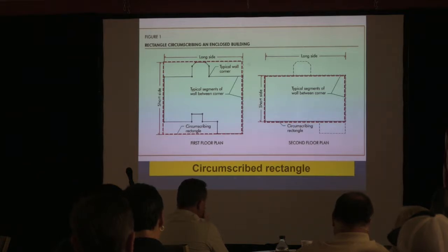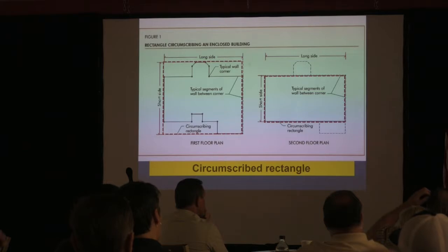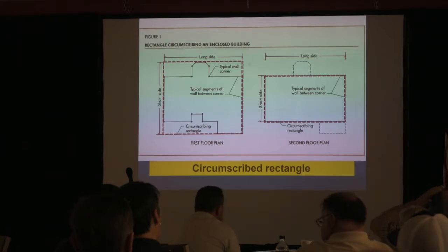Bill knows this, but do you guys know that hard coat stucco is actually a method of wall bracing? You have to fasten the mesh on there at specific intervals, but it's in that column there. So it is a wall bracing method because it does stiffen the wall up. I don't know, based on what we see, Bill, though, I don't really want to rely on that for wind bracing. That's what I'm saying.